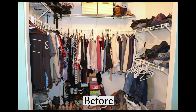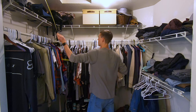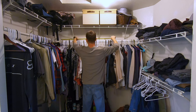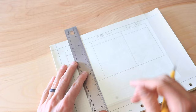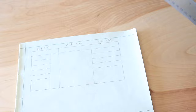Now that you know what to expect, let's talk about how to plan and design your closet, because that is a very important step. First, carefully measure the width and height of each wall in your closet and write down those measurements. Take note of any irregular features you'll need to consider with your design, and take a few minutes to sit in your closet and really think through where you want everything to be. Then draw a diagram and sketch out your design — you'll probably want to create multiple versions to play with it. This process can be a bit overwhelming, so here are some tips.